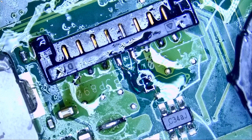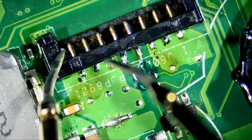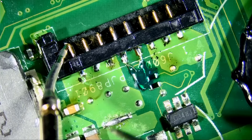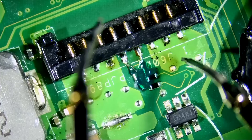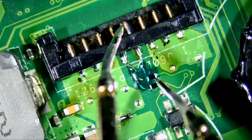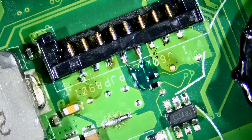We're going to need a lot of flux, and for ground and positive we need to use a bigger tip because of the thermal mass. Now to check if we have a solid connection, we can use our multimeter in continuity mode. Good here, good here, good here, good here. Very nice — and now we're going to measure from here to this resistor, and from here to this resistor. Beautiful — the connector is solid, we're all good.